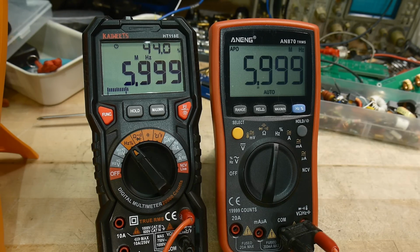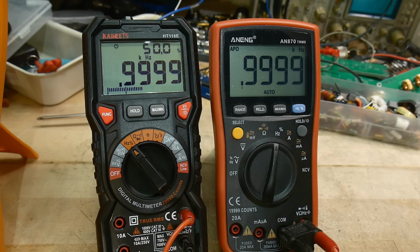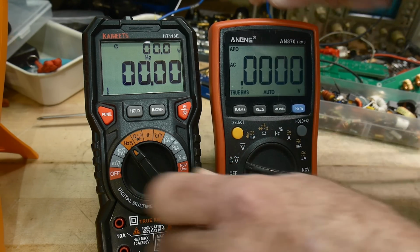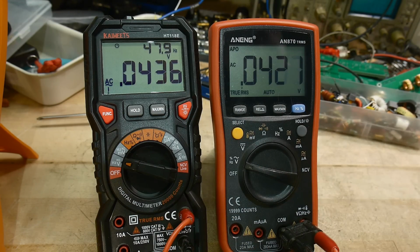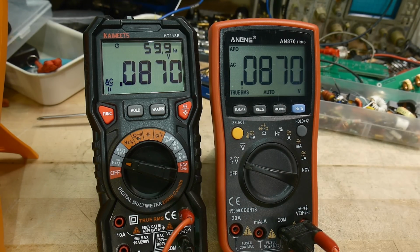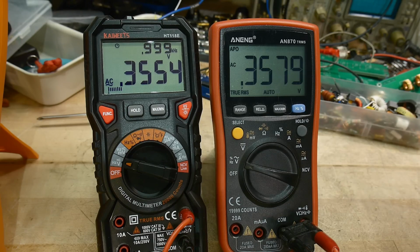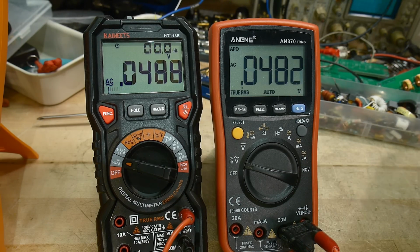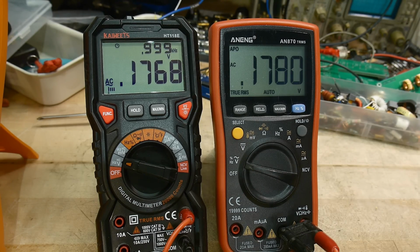1 kilohertz. All right. Now let's measure, let's see here. Let's measure AC volts. Here, and I'll go to here, and push the button. So now we're at AC volts. Let's see how they compare. All right, let me load this down first. Okay, so we should be measuring 500 peak to peak. Let me do RMS. Let's see here. Let's do amplitude.